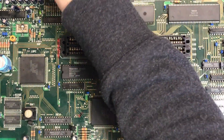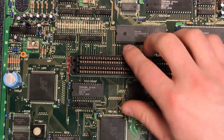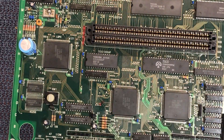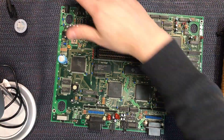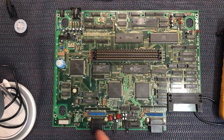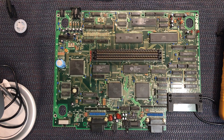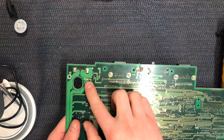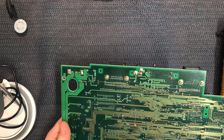We could in theory just run our power in - we could bridge the collector and the emitter together down at the EC points on the underside and potentially power the board. I probably won't do that though. Even though I consider this 5 volt power supply to be very good, it's probably better to run it through the circuitry it was designed for - that'll refine the voltage a little further, maybe do some current limiting. But as a quick dirty test, yeah, you could bridge those two points - the left one and the middle one - and the board would fire up.